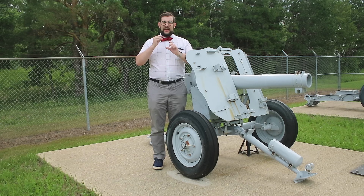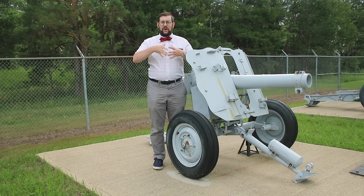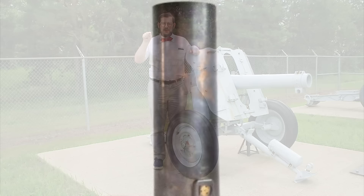Some of the major faults of the LG-40 included the firing mechanism. Like most shells, the shell casing had its primer in the middle of the rear surface. This meant the firing pin had to be housed in a streamlined casing in the middle of the venturi tube, and this tended to wear down very quickly and fail due to the hot gas coming out of the venturi. What Krupp did was move the primer to the side of the shell casing, allowing them to move the firing pin mechanism to the side of the breech. This required the shell to be loaded in a particular orientation, accomplished by providing a boss in the shell casing and cutting a notch in the breech.